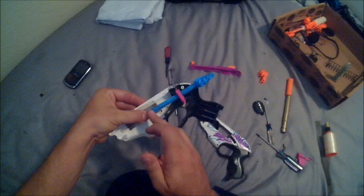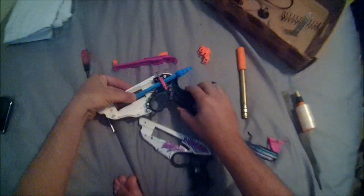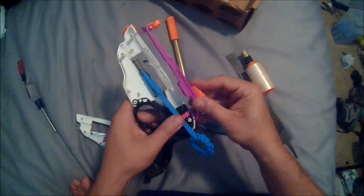If you're holding at a negative angle, the more pressure that's on it actually helps the catch engage better, not less. It's kind of like the messenger or the hammer shot, how it's actually held in by the pressure of the spring. Well, this is partially held in by the pressure of the mainspring. Very, very small amount, but it makes it so it has better functionality.